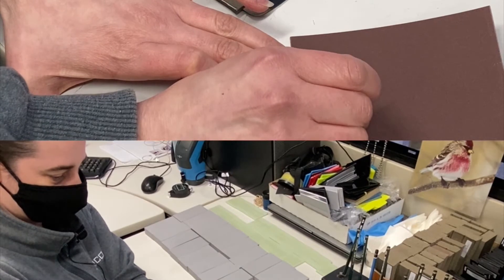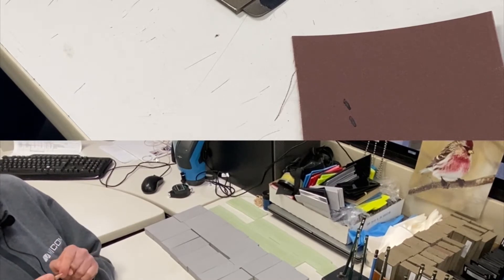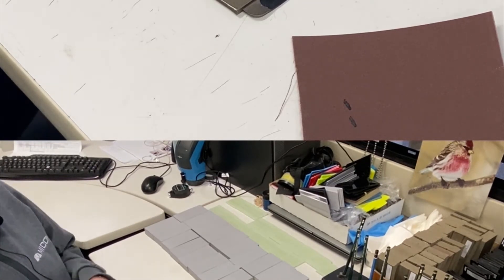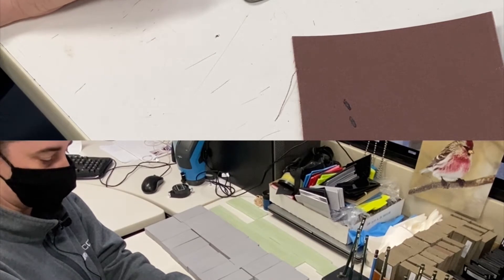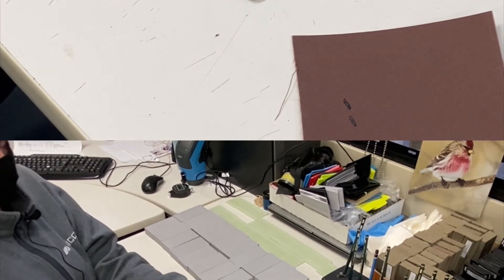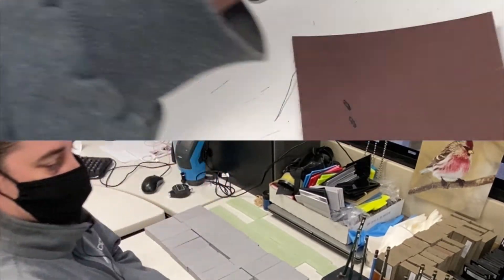You hold the pencil at 90 degrees, making sure the edges are very sharp, flat, and with no damage or nicks. It has to be five millimeters exposed. Then it's held at a 45-degree angle and pushed forward so it scratches the surface. They continue doing that across the sample.